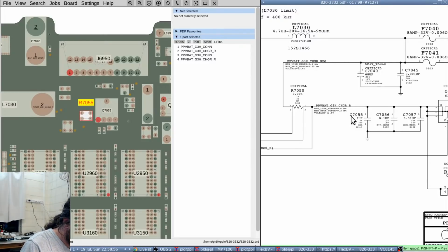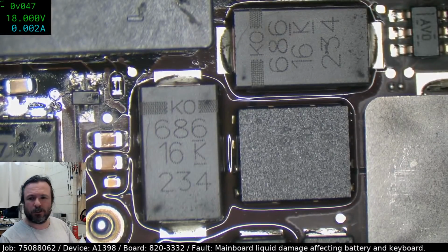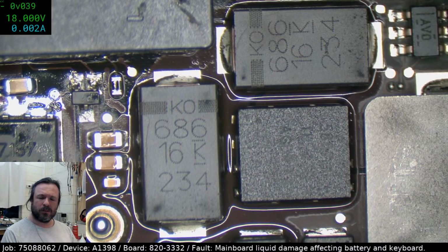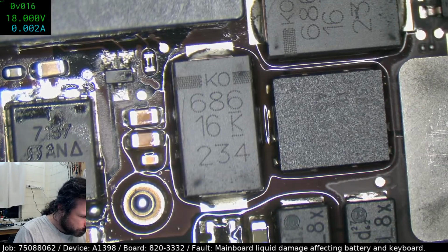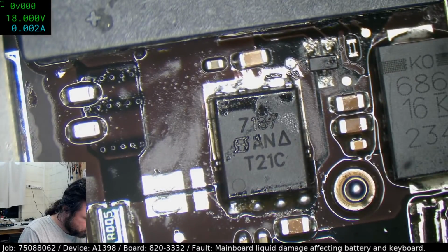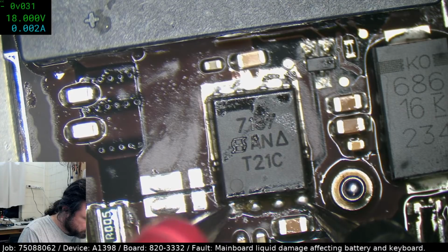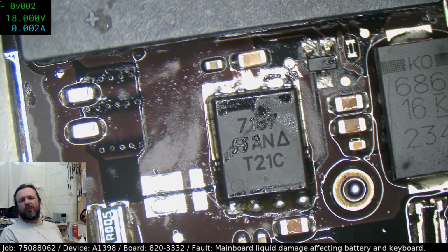Okay, what's my source gate difference? Because this is a... What are you? A P or N? You're an N channel. Okay, so we do need the gate to be higher than the source, usually by about a volt, hopefully. Doesn't have to be more than that, but a volt is a good start. And they're basically identical, which is not what you want.